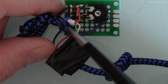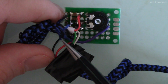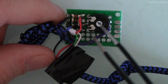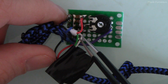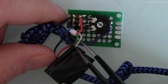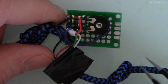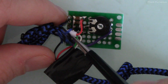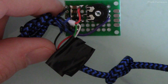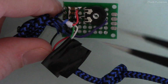basically, I just bought a cable. I bought an A to C cable specifically because the A to C cables only have 4 conductors. If you want to buy a C to C cable, it's a little bit more complicated because C to C has additional conductors for doing things like USB power delivery negotiation and stuff like that. So for your first cable, I would recommend you just do the A to C or the A to micro B or whatever, because it's only got the 4 wires and it makes things a little bit more straightforward.